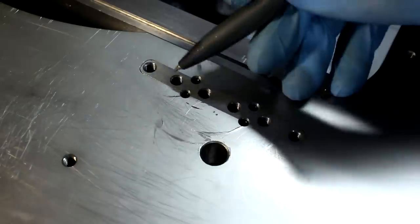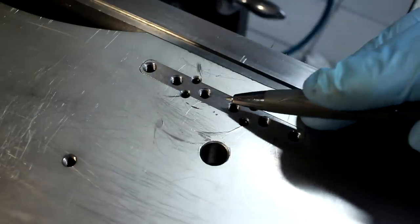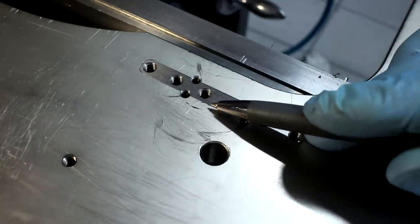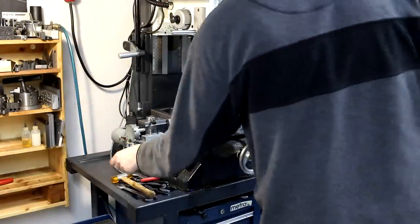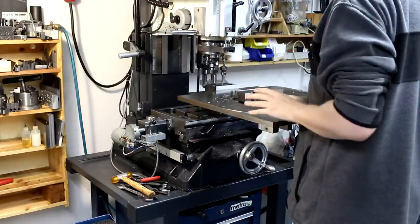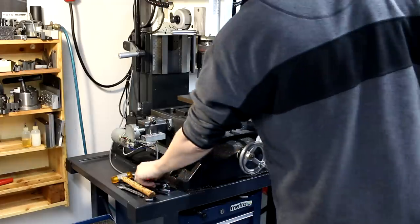That's the repair. I machined and milled the pocket out, then ground the inserts to final height so they are ever so slightly lower than the reference surface. Let's get this off the machine, check the dimensions, and get it all finished. When I loosen the vise, the part will not drop down because it's supported by these large parallels, which makes this a reasonably safe setup even as the part is so large and my machine is relatively small.